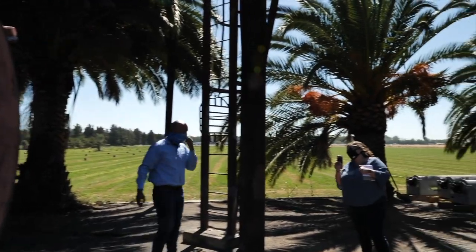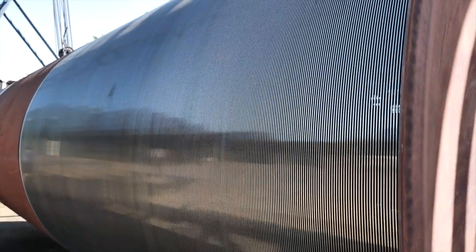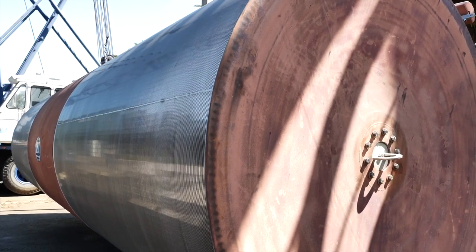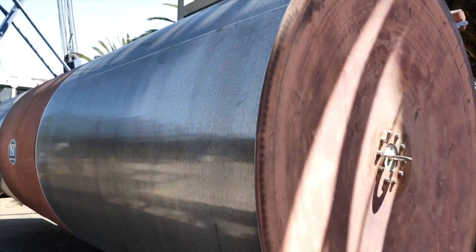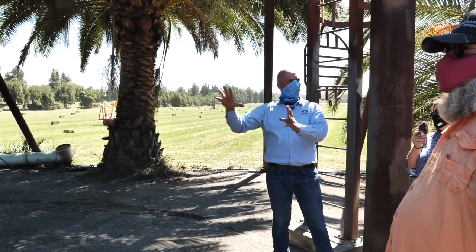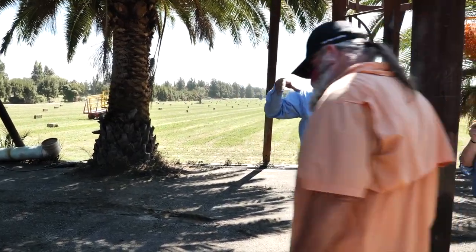Each one would do this? Yes. And do they run 24 hours a day? No. A typical cleaning cycle would be that the screen rotates like this for a minute forward and a minute reverse, and then it shuts off. It might shut off for 6 hours or 12 hours, whatever it's set to. In an area where there's a lot of sweeping flow, debris doesn't accumulate on the screen. It's mostly being swept by, and we're just keeping the algae from growing on it.